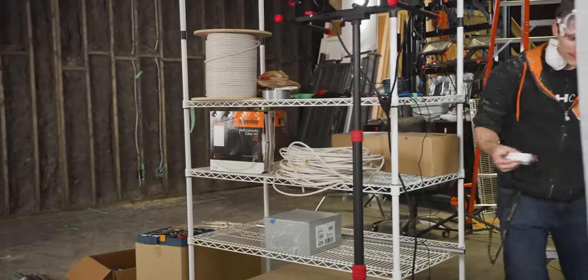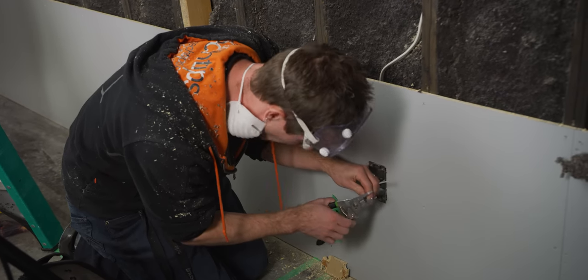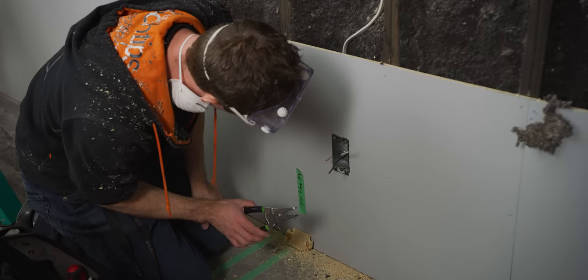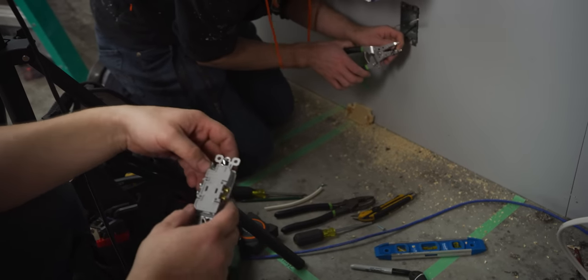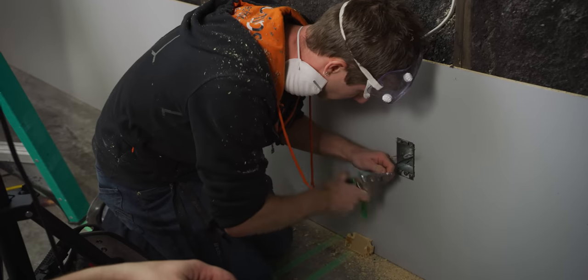Do you want to actually install the plug? Let's find out if I know how to do this. So there's your strippers. Yep. Strippers are on the floor. I didn't know you were bringing strippers to this whole party here. So I should probably hold on. I know. I'm gonna do the. Fine, tell me. I make a point of not using the quick connect. Fine, I'll use the other one then. The reason being, I've actually seen those connections melted and the insulation on the wire melted a ways back.